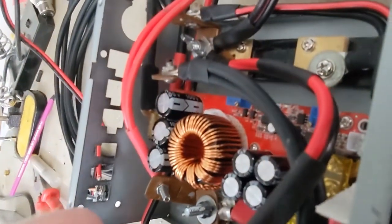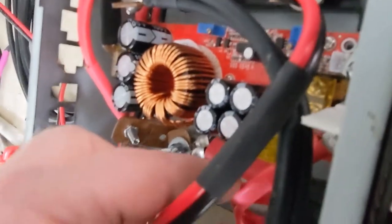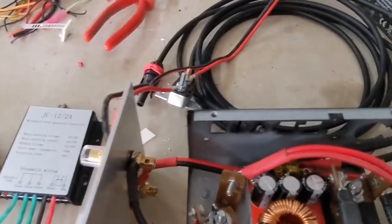That will give us at this end drawing around the maximum. We've got 12 gauge by two, which gives us about 9 gauge, supporting maybe up to 40 amps — you probably want to be on the lower side of 40 amps for that. Because the wiring on these devices is actually pretty small, there is a copper bus bar coming off there instead of trying to wire heavy gauge wire onto that small connector. We also have a bit of safety separator to make sure we don't accidentally short out those very closely associated terminals. So we'll be coming in at around 40 amps and going out at 90 volts, around 5 to 6 amps, via our PV cable.